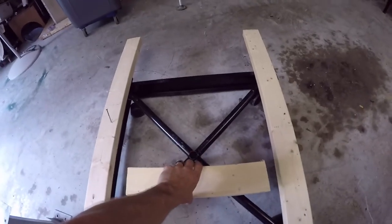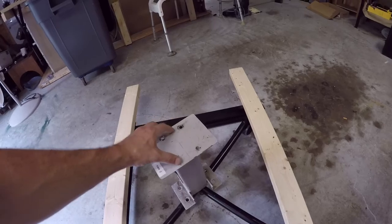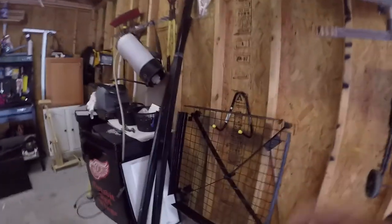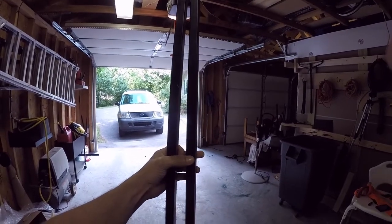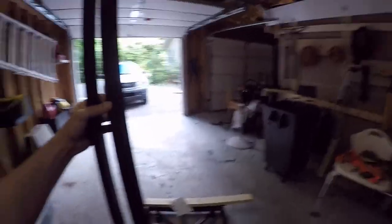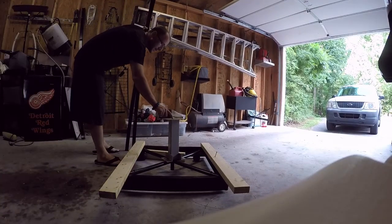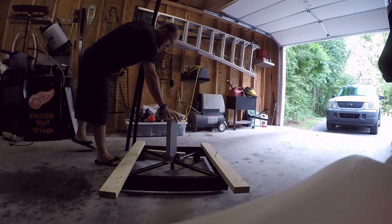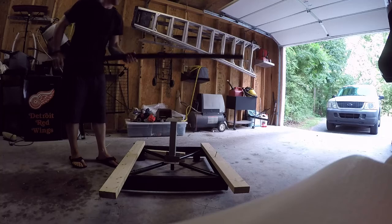Once I've got a wood frame built all the way around it, I can take another piece of wood and run it across through the top. This is the mounting plate — this is what we're going to use to physically mount the two L brackets that are going to hold the actual crane in place. These are the support arms, and they will have to be measured and cut with a spacing in between them. I got plenty of bushings and washers to fix that. This platform actually needs to be way up here, at least up to my chest. Once that's attached, the rails will get attached through the brackets.